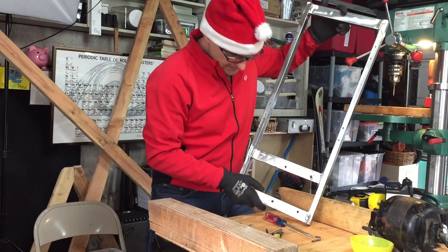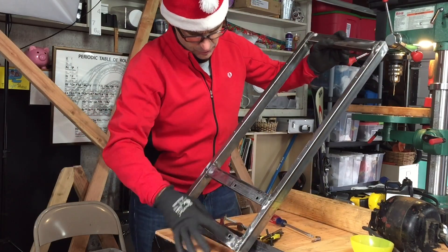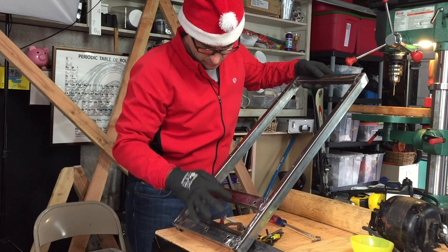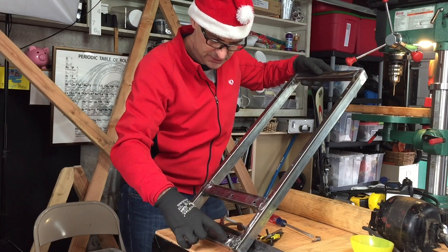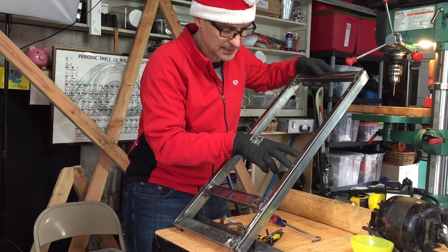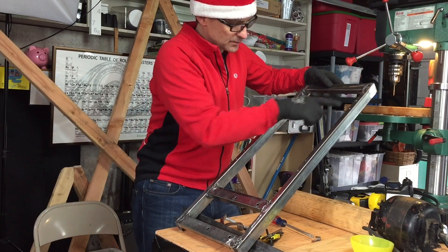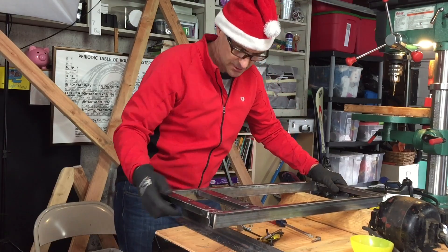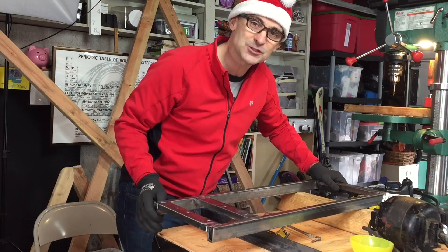Okay, so now I have all — 2, 4, 6, 8, 10, 12 — holes all drilled and all tapped. So now I'm ready to take my 3/8-by-16 thread-per-inch machine screws and bolt the motor on, and then my number 10-by-24 thread-per-inch screws to put my pillow bearings on, attach the belt, plug it in, and see what happens. That's our next step.